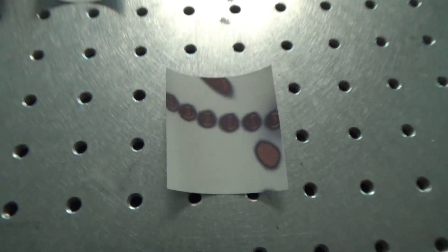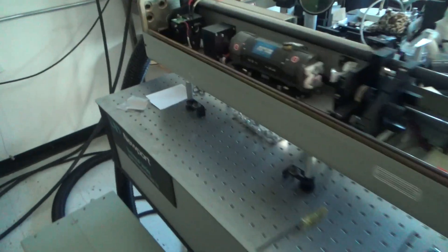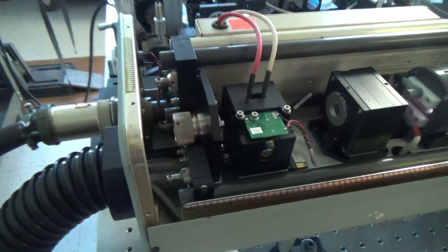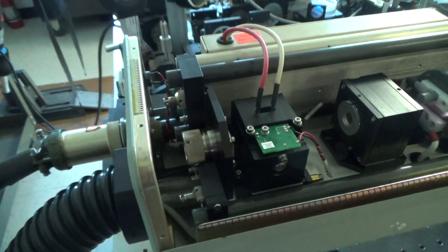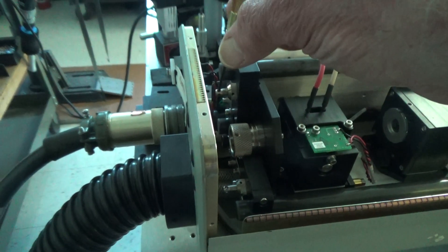You can see I've got a fairly nice energy distribution — it's not as hot on the sides, it's hotter on the top and the bottom of the beam. And that's because the flash lamps are on the top and bottom side of the YAG rod. So that looks fairly nice. Let me show you what happens if you actually do an adjustment to the rear mirror. If, say, the energy was hotter on top of the beam, I would like to lower the beam down. By turning this screw clockwise, I'll be pushing the mirror forward and should do exactly that.